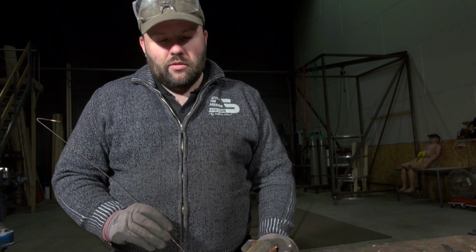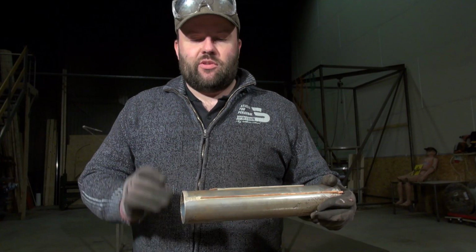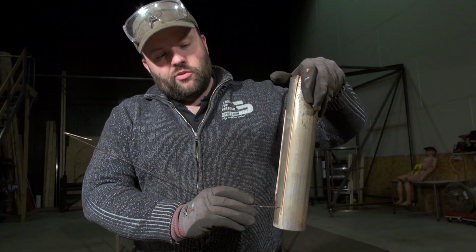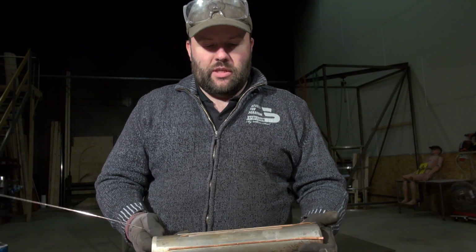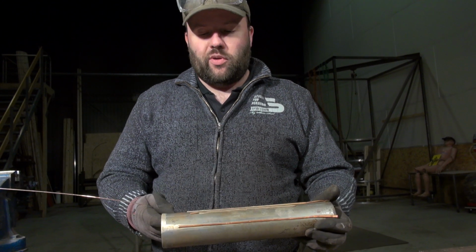So what we want to try to do, and now we are going for full score, is to solder an entire inner liner the next time we do a soldering attempt. So what we are going to try to do is make a hybrid out of these two examples we have here. First of all, we're going to do the next soldering attempt with the inner liner of the rocket motor lying down like this. We can't have a big difference of height where gravity can pull the silver solder material a long way. So we'll have to do it horizontal. That's the first part. The gas chamber can easily be modified to do a horizontal soldering process.